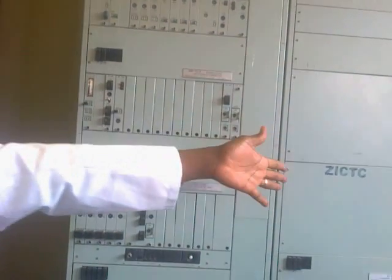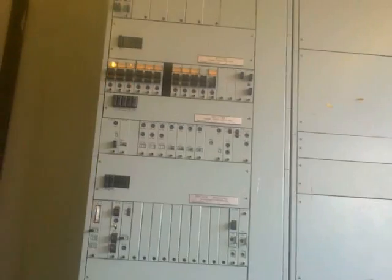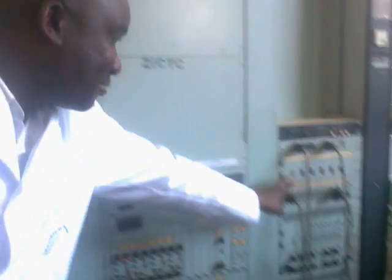We also have the two wire, four wire. I don't know if you've talked about the hybrids. The system consists of four wires: a transmit pair and a receive pair. Usually what comes from the subscriber is two wire, so there has to be conversion from two wire to four wire and vice versa. The equipment uses four wire, so that is done in the hybrid. The hybrids are incorporated, and the hybrid does the translation from two to four.